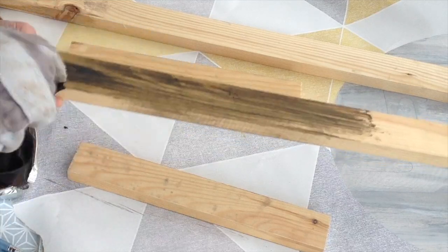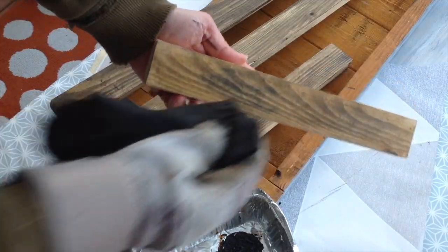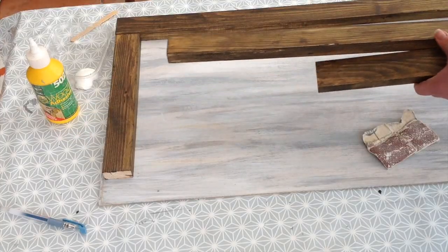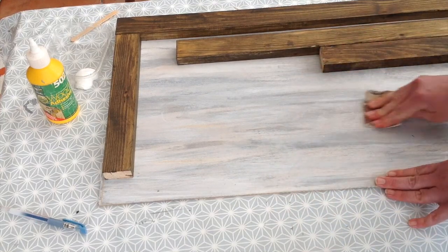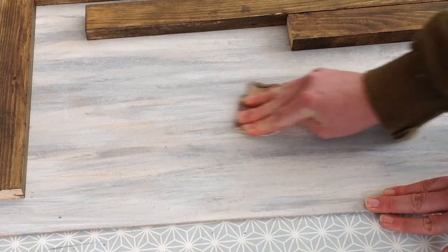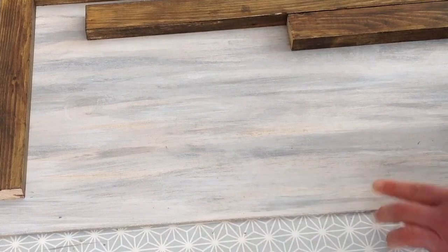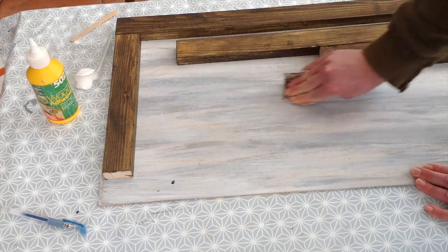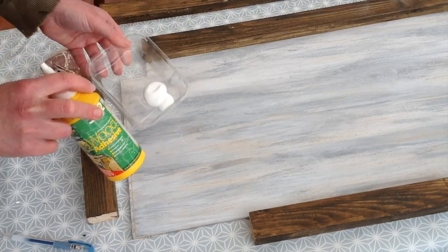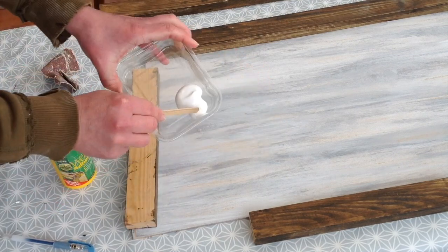This is a mixture of both the brown stain and the black acrylic paint. You could also leave the battens bare or add a clear sealant over the top — just make sure you rub it on going with the grain of the wood. I've left those to dry and now I'm going back to our baseboard; I would just like to warm it up a bit because we did it white and grey. I'm taking my sandpaper and just taking off a little bit of the paint so that we see just little bits of that brown MDF wood below, which gives it a little bit more character and it's going to look great at the end.